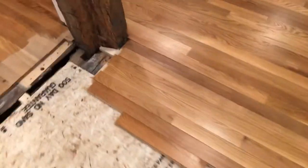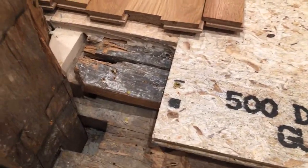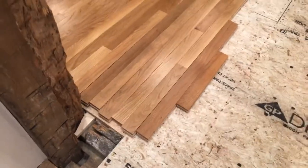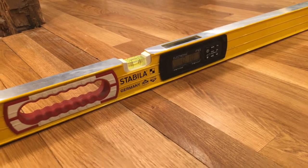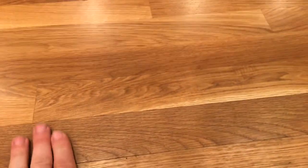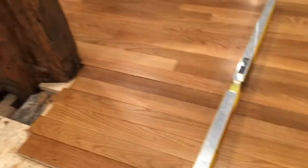This is an area where you've got the OSB, then you've got your carpet shims, and then I've just set some wood on top. It's obviously not done, but let's see what it reads — 0.1. That's really a lot better than I thought it was going to be. There's still work to be done. I've seen a high point where I have my staples on the carpet shims — you can feel a little high point — so I'll probably knock those down and sand them again. I'm using a ton of glue to put it all together.